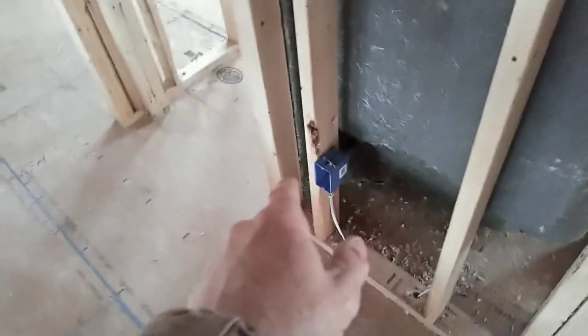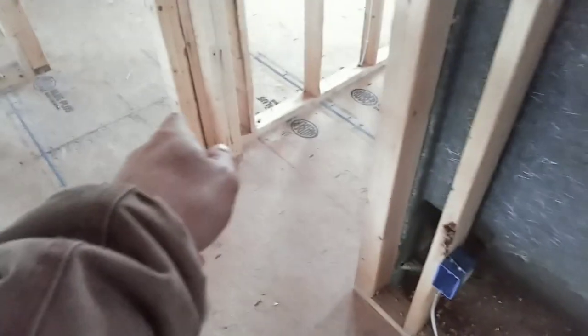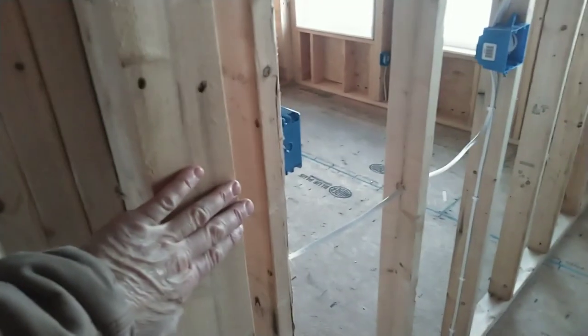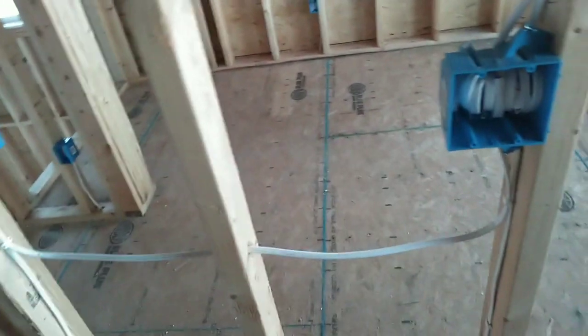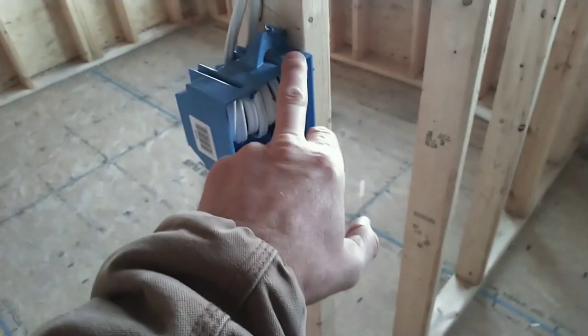This is a hallway outlet serving this short hallway that starts there and travels down to this door jamb. This is a full bath — got the shower on this side, an exhaust fan light combo; I usually install the Broan 678 model. There's no wall space for switches here, so with the door swinging this way, I've got the switches installed so the edge of the door stops right before the switch. I just choose not to land switches behind the door — I want to be able to see them when I walk in. Got a vanity light and the exhaust fan light combo. It's a really small bathroom.